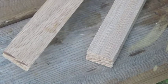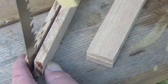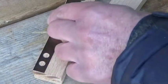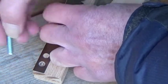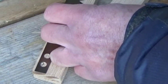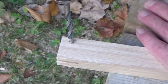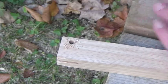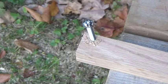Next thing is to set it up to drill the hole to put the saw in place. It's going to go inside here and it needs to swing around. When the hole is drilled I'll take the screw, screw it through there, and the blade will swing back and forth and rest inside the handle of the saw. I've drilled a pilot hole because sometimes with wood it doesn't drill evenly. That's a snug fit and there's just enough wood there that I can thread it in place and keep the saw from moving around.